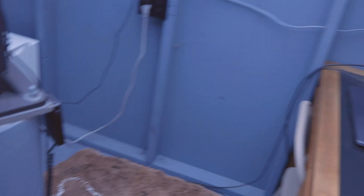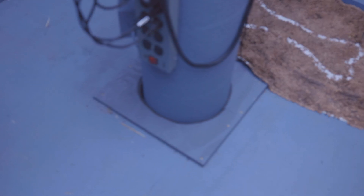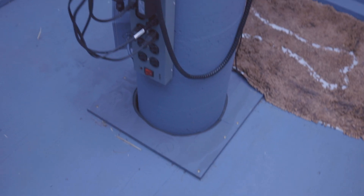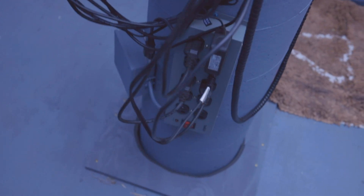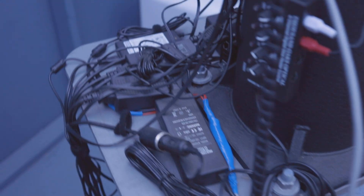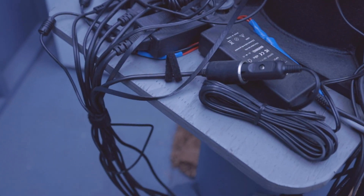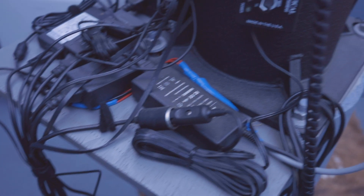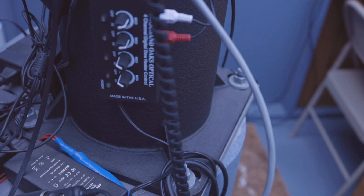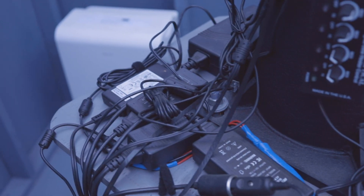Now to the main guts. This is the concrete pier, which is isolated from the walking deck so that you can walk around in here and not have vibrations transfer through. Here's my power panel. I've got some plywood in between the metal pier and the concrete — it sort of dampens the contact between them. I left a little bit of shelf on it, which ended up being space for all my power converters.